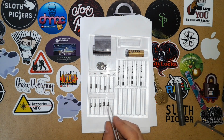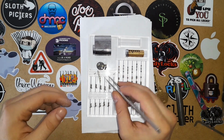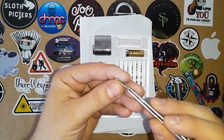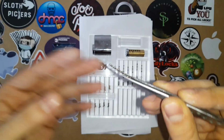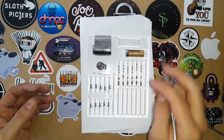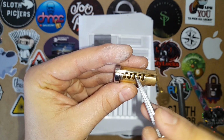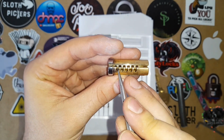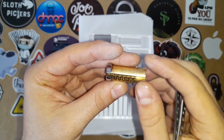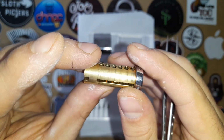We talked about the side elements. There are 5 split in 2, so that makes 10 elements. We have the sidebar, which is just one straight line for the true gate of the side elements to go in. Here we have the sidebar groove. Here we have the chambers for the split side elements, and as I explained, 2 of them fit in one chamber. On the main stack we have barrels with matched milling.